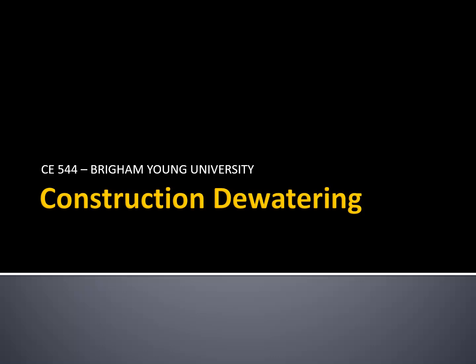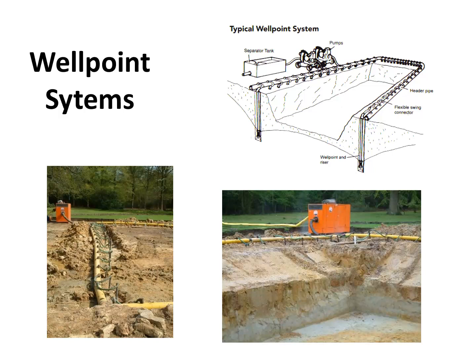Welcome back, everyone. In this lecture we are going to talk about construction dewatering. Specifically, we're going to talk about how we use some of the analytical solutions we found to design systems to dewater excavations. And this is a fairly common engineering and construction practice for regions with high water tables.